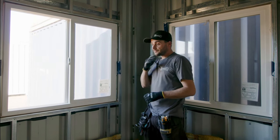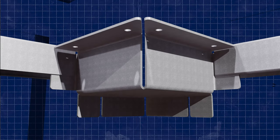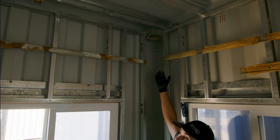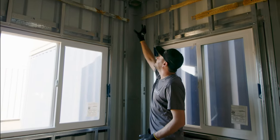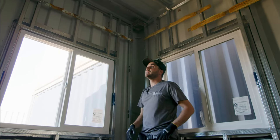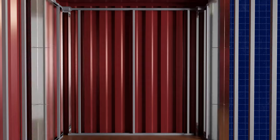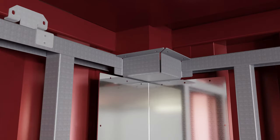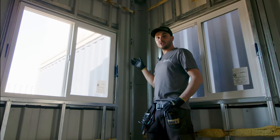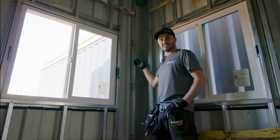When you get to the end wall, included with the steel stud bracket kits are corner casting covers up high. These covers allow you to have a solid two inches of spray foam all around the corner casting and still allow all your interior trim to come up to the flanges and connect securely. On the inside corner, after spray foaming we can come down from the corner casting cover with an angle iron to give us a drywall return on the inside — installed after spray foam so it's not in the foamer's way.